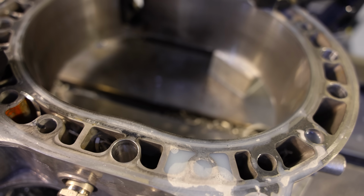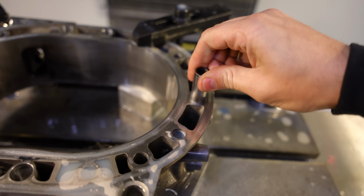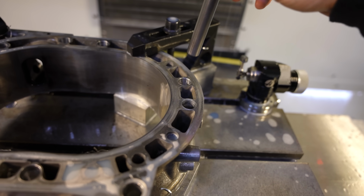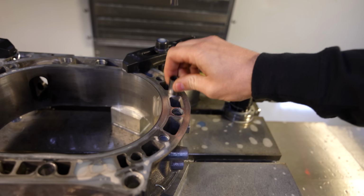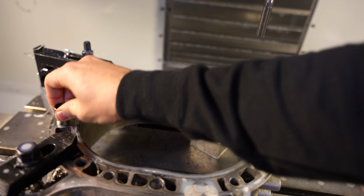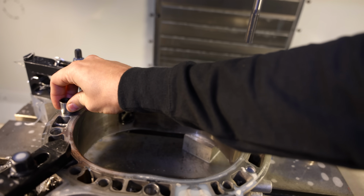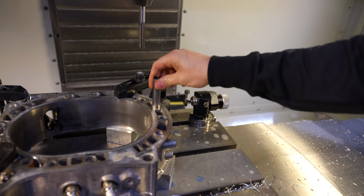That was it. Just check this out. That is super clean. Got some improvements to do, but look at that. You can't even clink it, but it's smooth. So each one of them kind of has like this half-inch start that's a little rough. You can't hit side to side. Yeah, this one has a little bit more slop because we were dealing with the wrong speed and feed rate. Straight through, and no slop.